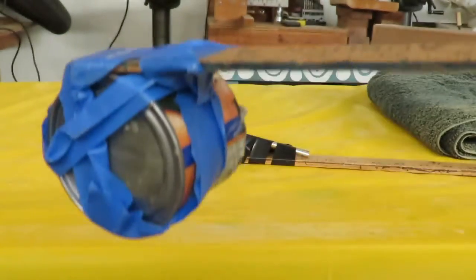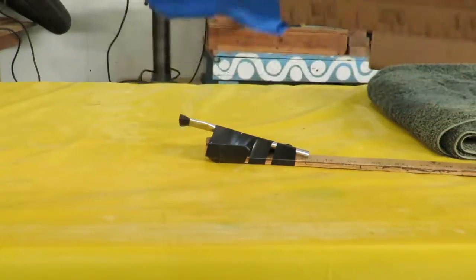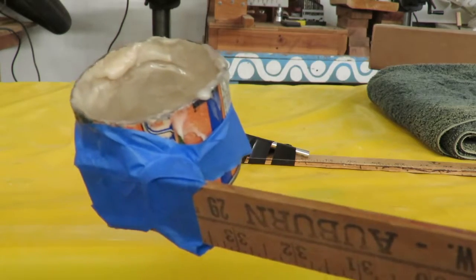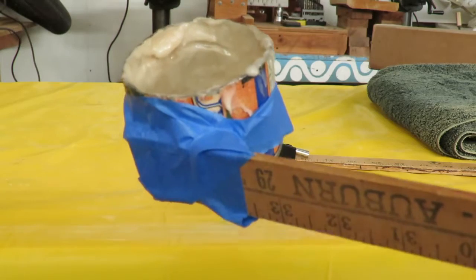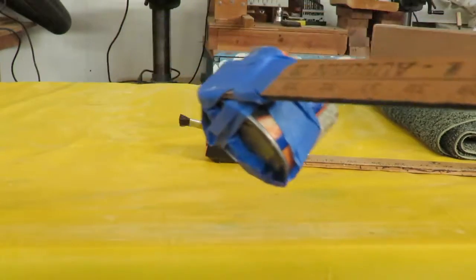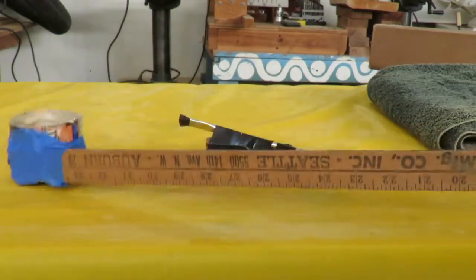If we dump it off that side, maybe a little better, but we can dump it off either side. We'll be dumping the epoxy into the V space between the hull planking, where the hull planking meets the deck, and we'll be moving this along and not so much dumping it as pouring it precisely so we have an even amount of epoxy the entire length of that space.